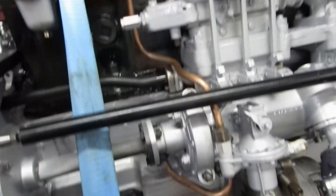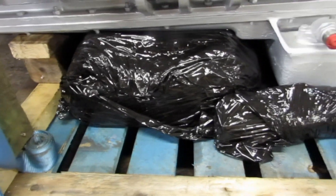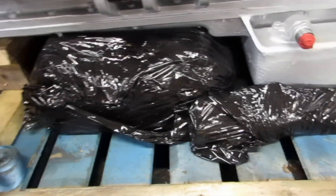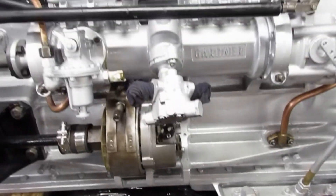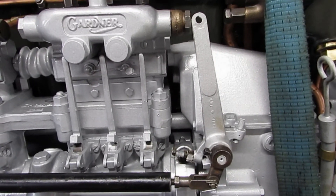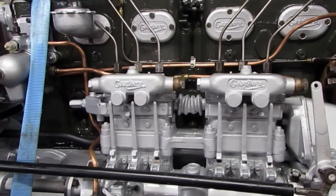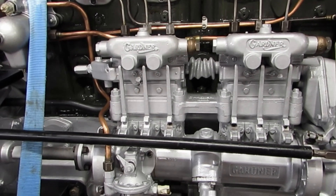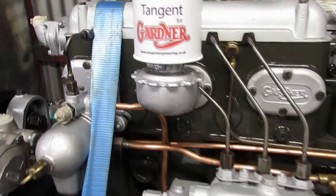Underneath here, unfortunately already packed away, we've got the oil cooler — a standalone oil cooler — and we've also got in this package here a Morse controller. This engine is not going to use the conventional throttle; it'll use a Morse cable so that the gearbox — I believe it's a hydraulic gearbox — and the throttle will be activated at the same time, much as you would have on a boat.